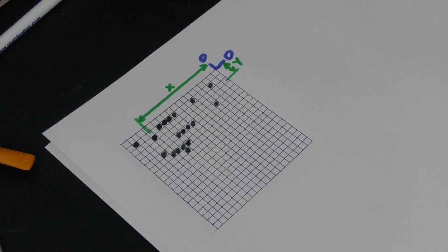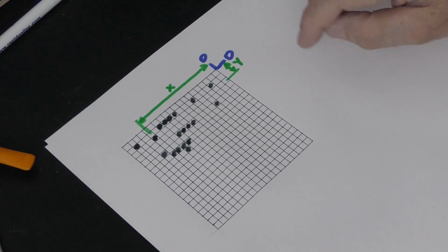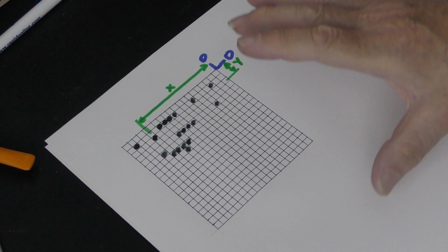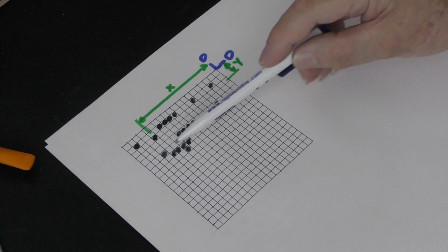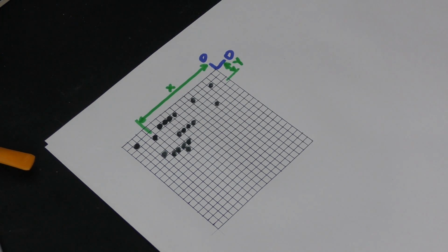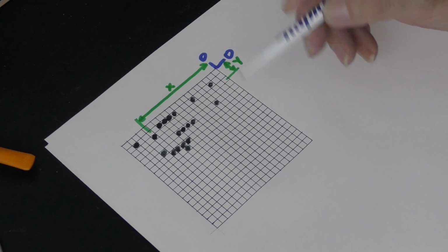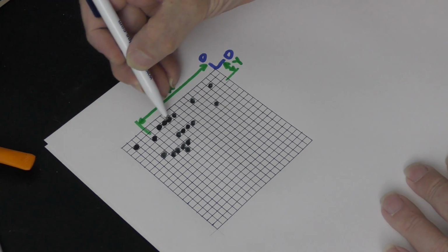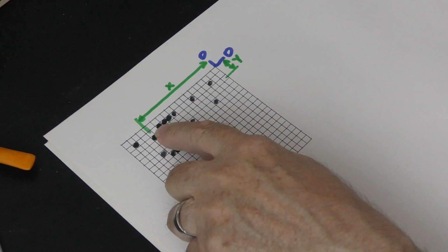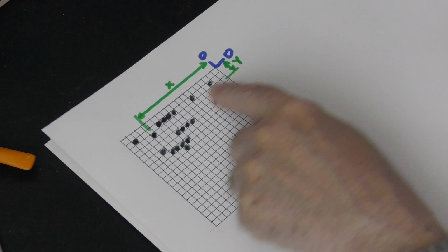Now, as I mentioned earlier, the image that we're going to send down to Lightburn or RDWorks or wherever is basically going to be something called a bitmap. It's a grid on which all the black pixels and the white pixels are defined. So relative to a corner 0,0, every single square in this bitmap has got a dimension. When you send your picture down to the controller to be printed, it does a scan line across here. It's just switching the laser tube on and off according to what it sees in the Y scan line.